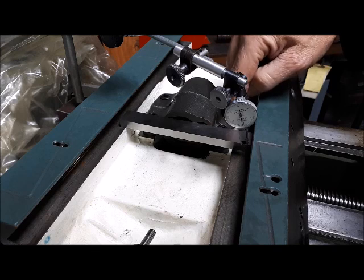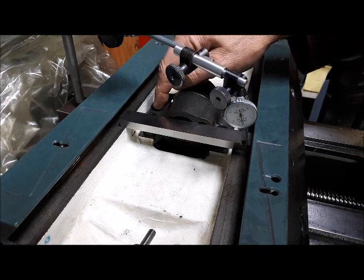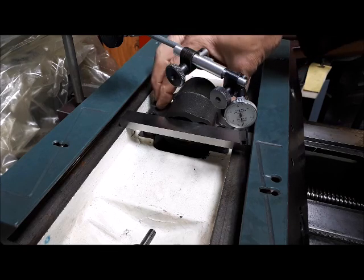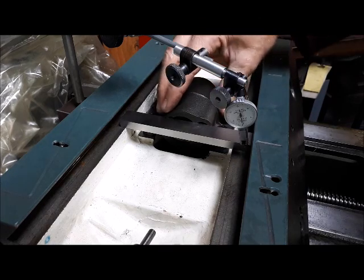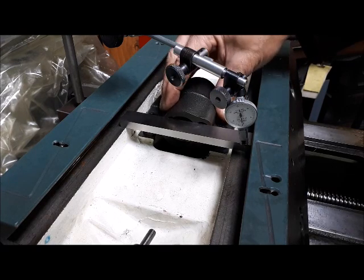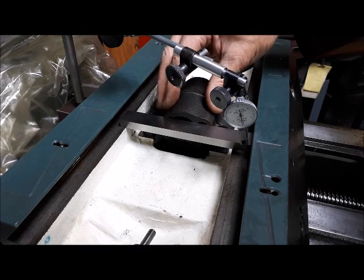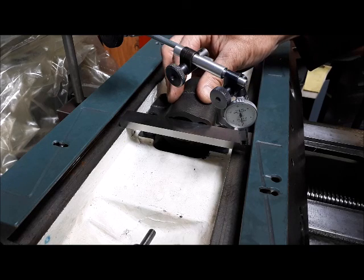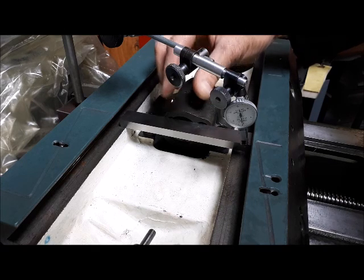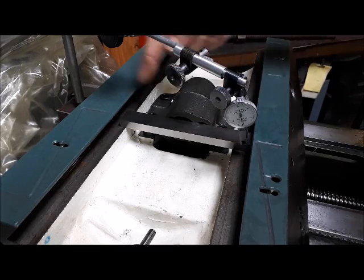Without the table on, I'll use the spindle and drill for the dowels to go down through here once I get it locked in position. The other thing I have to check is that this is running true — I have to make sure it's positioned longitudinally in the saddle correctly for the X in-and-out screw.